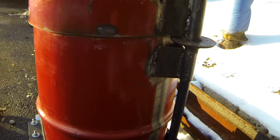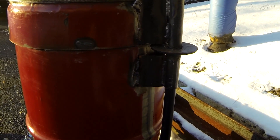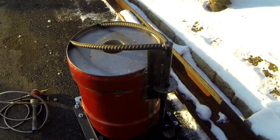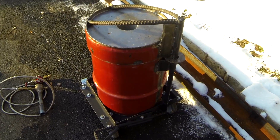There are a lot of people that use a four-part perlite and one-part furnace cement mix, but I found that tends to crack and then you've got to reline the furnace. So I decided to go with the real stuff.